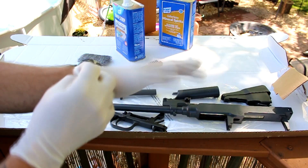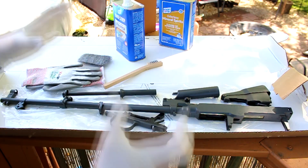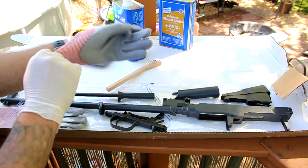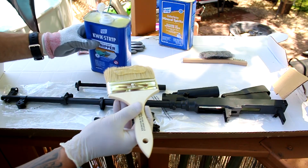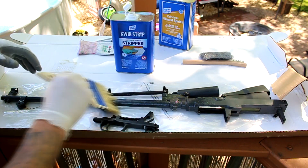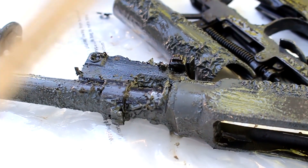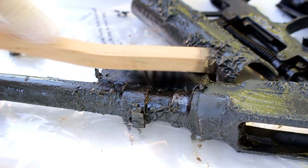When using this paint stripper, I'm going to go ahead and use two sets of gloves — one latex set and another more durable pair that I can just throw away, because I'm working with sharp components and this paint stripper is just probably not the best stuff to have on your hands. I'm using your typical paint stripper — this is Quick Strip — and you just liberally apply it to the entire surface you're trying to remove paint from. I'm putting this on with a paint brush and then going through with a metal wire brush and scrubbing into it after about 15 minutes of waiting.